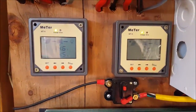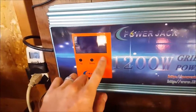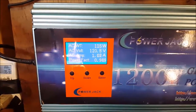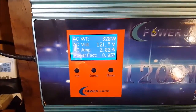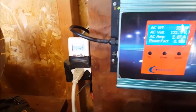Now we're going to flip it from my charge controllers. I shut my charge controllers off — I've got these two breakers: this is the main breaker for the inverter and then these breakers for the PowerJack. Turn it on and watch what happens. There's one bank of solar panels, so instead of hearing the fans come on right away, it just starts making power quietly and happily. Now let's flip the other bank on — yep, everything's on together and we're making power nicely.